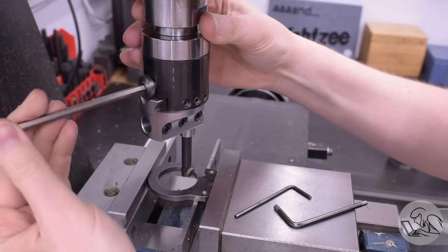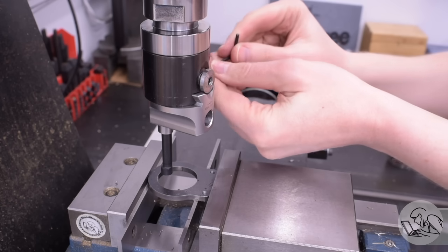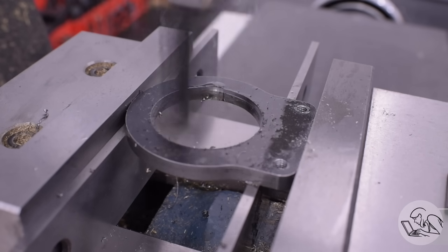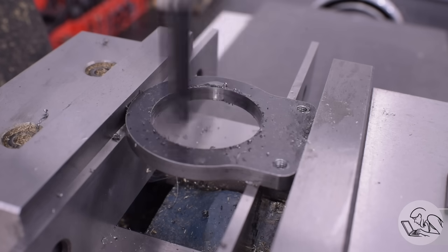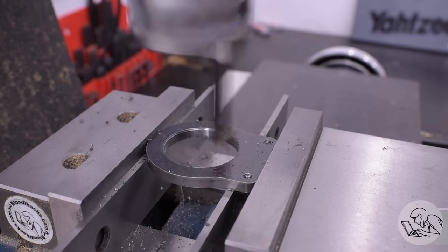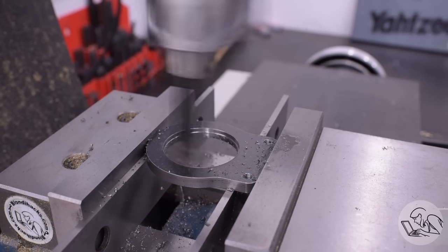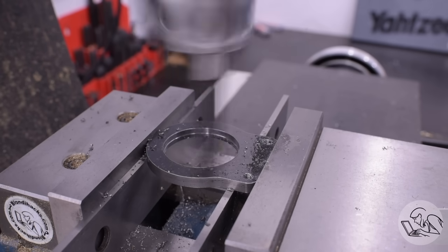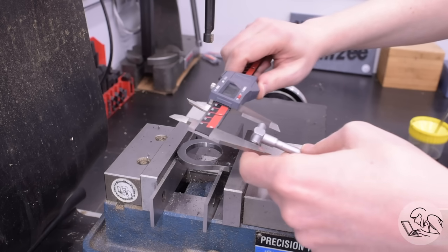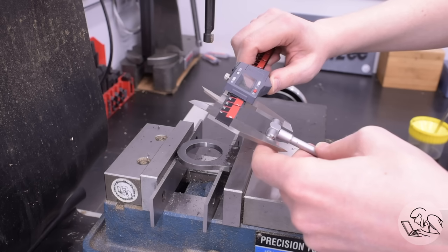The first step with a boring head is to touch off on the work, just like you would with any other cutting tool, which generally means spinning it by hand and advancing it a little bit until it starts dragging. Then you can move it up clear of the work, dial in some depth of cut, lock it down, and away you go. The first couple of cuts are going to suck because we've got to get through that laser candy shell, and a small boring head like this is not rigid enough to do it all in one pass. The real trick to these small discount boring heads is to get the cutter on center. They usually come with brazed carbide cutters, which are very sharp and work just fine, but they have a large offset from center, so you have to rotate the tool until it has a bit of a negative rake on it to get a good cut. This boring head is marked in imperial and of course we have a metric dimension, so I'm using my telescoping bore gauge and I'm going to have to use the guess-i-meters because I don't have a metric micrometer big enough to measure this, but it'll be okay.